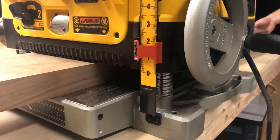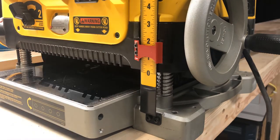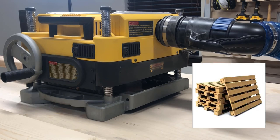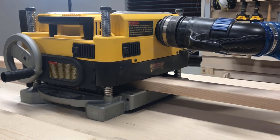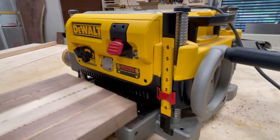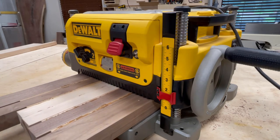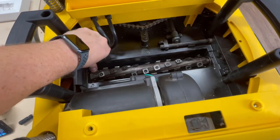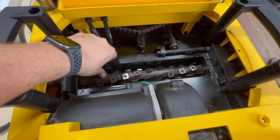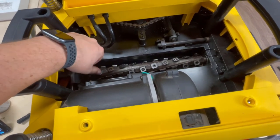On the flip side, if you're using your planer daily, batching out large collections of wood, or dealing with reclaimed or pallet wood that's more prone to damaging a cutter head from a loose nail, then the Shelix makes sense for you. If you put cut quality aside and just look at the economics, the break-even point is anything over six sets of fresh knives — after that it pays for itself. Like many things, my recommendation largely depends on the individual woodworker and their situation. I hope this review offered a valuable perspective to enhance your decision making. Thanks for watching and I'll see you on the next one.